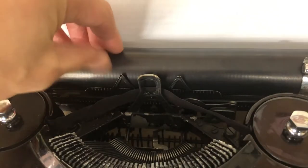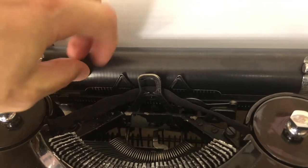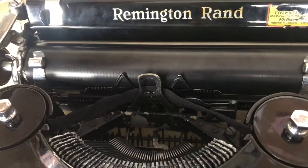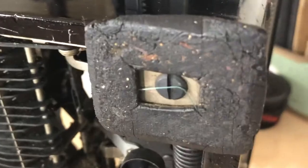Pretty much as expected on a machine this age — it's 85 years old at this point. The feed rollers underneath the platen are almost completely dried out; they're not gripping the platen so the paper is not rolling through. You can also see that this platen is hard as a rock and shiny. This is a very, very old platen and it needs to be redone. In the same way, the typewriter's feet are ancient — hard like rocks and splayed.